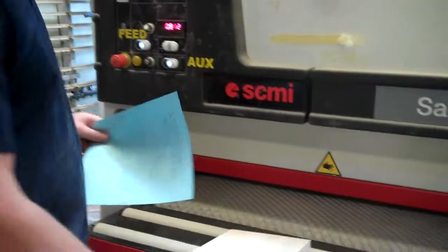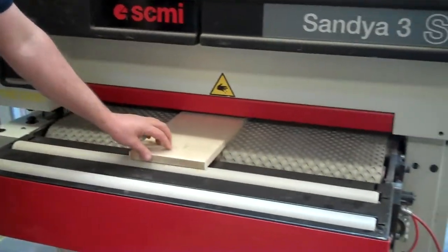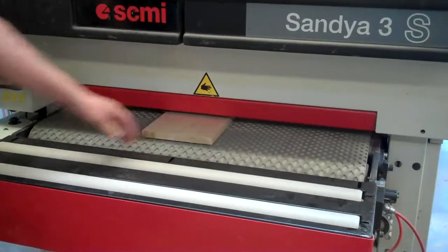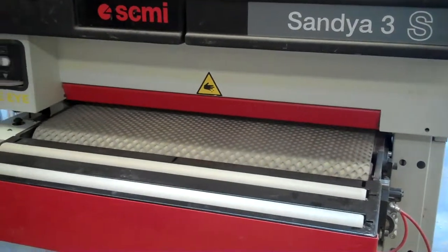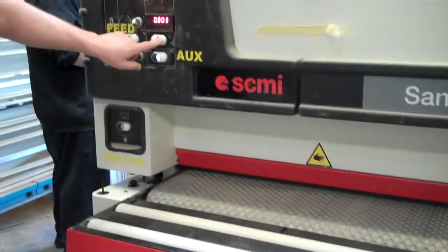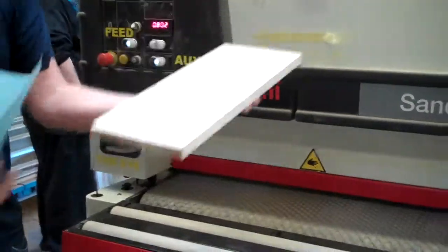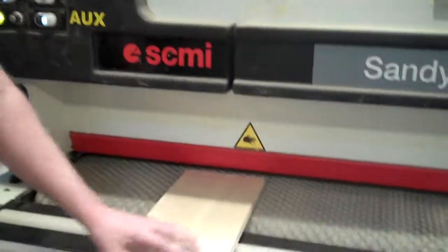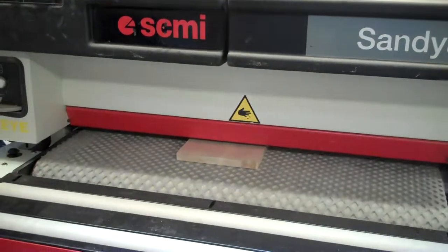We'll send it through with the grain. Go down that 100th of an inch, so that's 0.802. Put the board over, get the other face. Keep going all the way down to 0.750. You guys know how to do this.